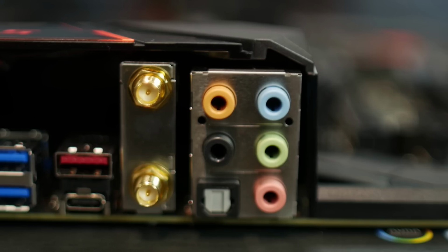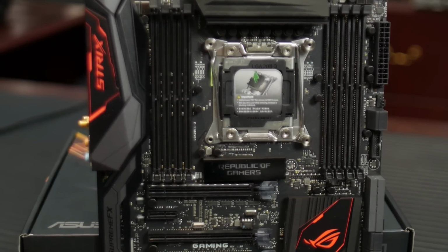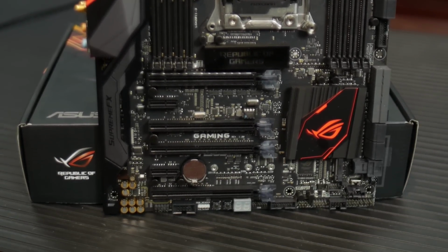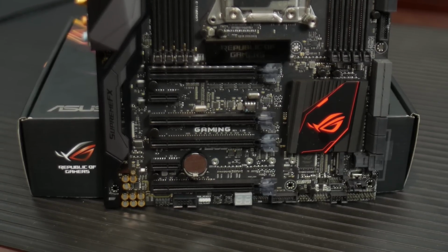So I think this is actually probably okay, because you would never physically be able to use that by 1 slot with a double height graphics card. So while there is a by 1 slot there on the motherboard, it's actually also wired into the wireless controller. So if you're going to use the wireless controller at the back plate, that by 1 slot is effectively disabled. So I probably would not have even soldered it on the motherboard for this particular SKU, because you're not going to be able to use it if you're using this with a graphics card, unless you move your graphics card. And depending on where your graphics card's located, it's always going to be blocked. You're never going to want to run a graphics card out of the PCIe X4 X1. So this layout is kind of unusual, but I really can't fault Asus for it, because they've got to support both the 28 and 40 lane CPUs, and they're just making the best of the situation that they can.